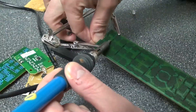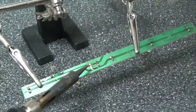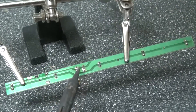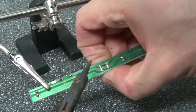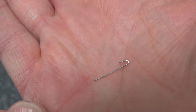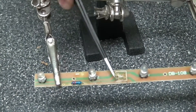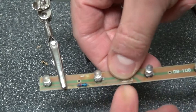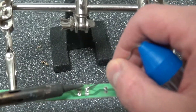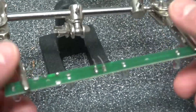Basically what I'm going to do is desolder all of those regular LEDs. I'm also desoldering this switch because I'm going to put in a new switch. I'm going to use a wire here to close the circuit on the switch — attaching a new switch not to that section of the circuit, but somewhere else.